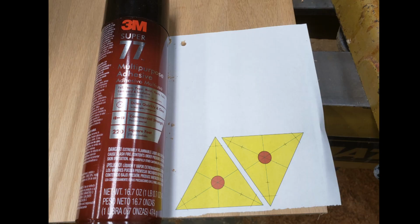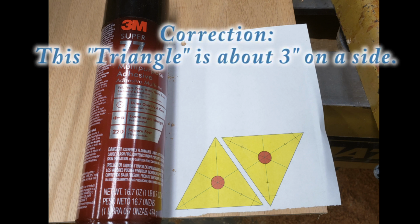For flat projects like this, nothing beats having a disposable pattern. I used CorelDRAW software to draw a triangle with a center with truncated corners and marks for the center and for the hold-down washers. The truncated corner gives a flat for the wire. Any decent drawing software would do, including hand-drawn. This one is about 3 inches, but an exact size is a personal choice.